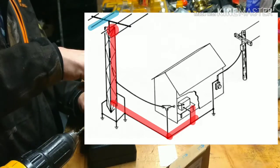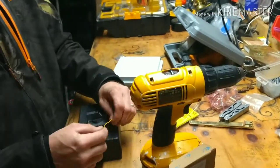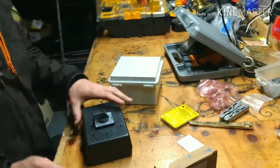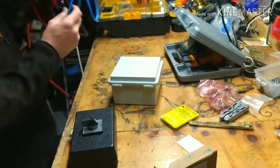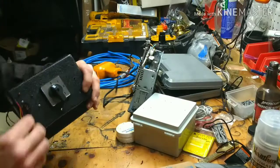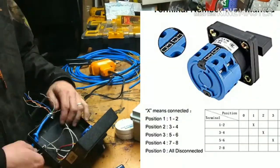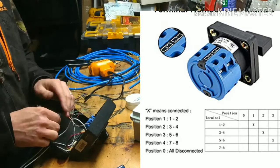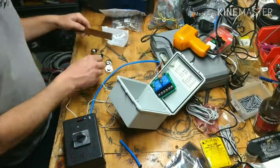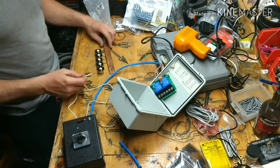I'm going to be operating four different dipole antennas off a quad band radio. I dismantled a stereo head unit to utilize the fuse slot in the back of the head unit to install into my switch box. This is the rotary style selector switch that I ordered from Amazon along with the wiring diagram. The switch, the relay boards, and the LEDs were all around 30 bucks, so it was low cost to build this project.